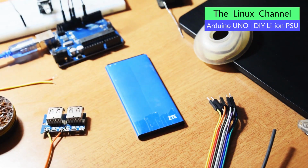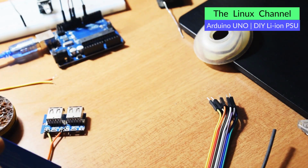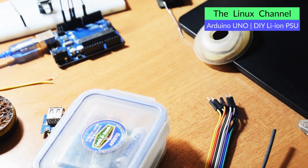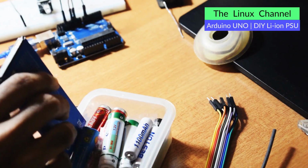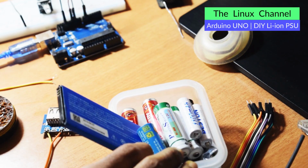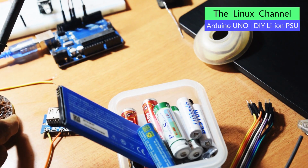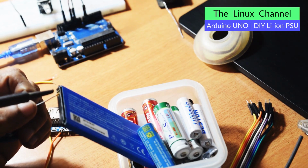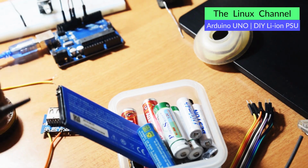It's done. We can do one thing with the battery as well. It is quite dangerous, but I need to be quite swift because any wrong move is going to overheat that circuit or the battery itself. So let me try to mount it in some way so that I can get that access. Let me keep it this way so that I get a better viewing angle and can see what I am doing. So I can quickly wet those contacts and then solder the wires. I need to be quite fast when you do something like this, and moreover you need to be careful with that middle pin.